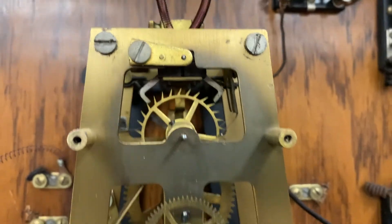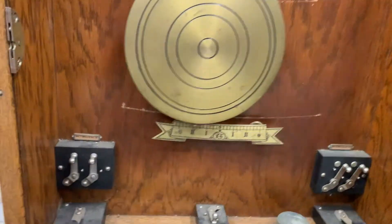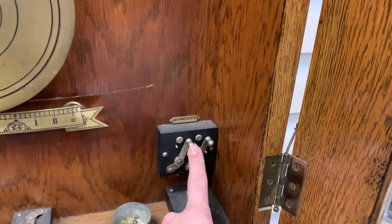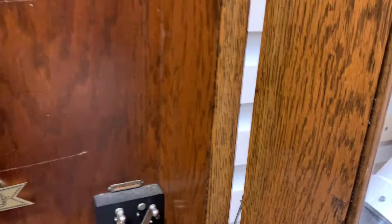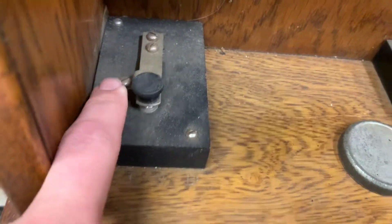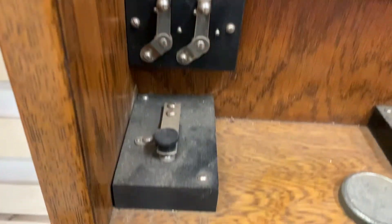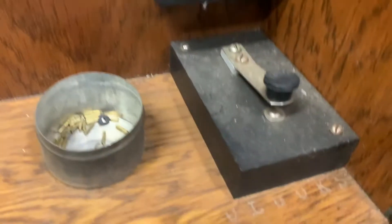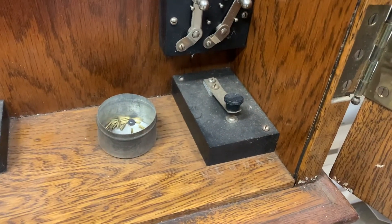This is all making pretty good sense. Down at the bottom of the clock we have some bell selector switches. These will determine which zones will ring: zones 1, 2, 3, and 4. If these switches are to the right they're not connected to anything; if they're to the left they make contact. There's also a button labeled 'wind' — if I push this, we can manually wind the clock. This one over here says 'clocks,' and I believe this advances the slaves.